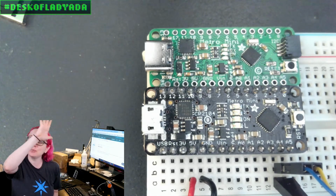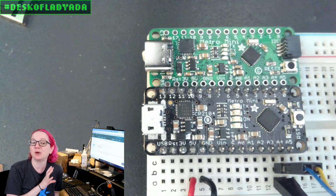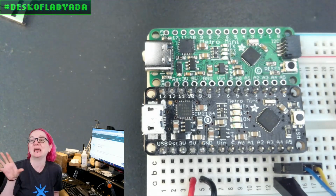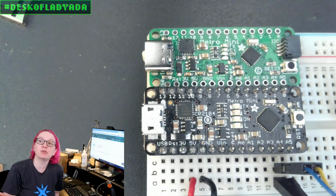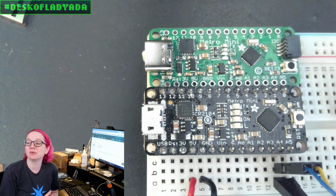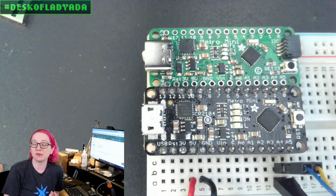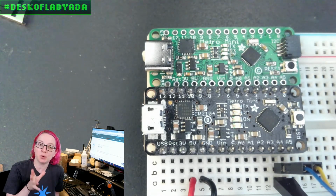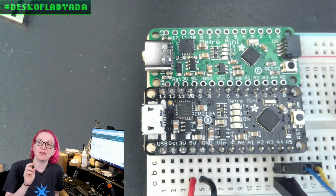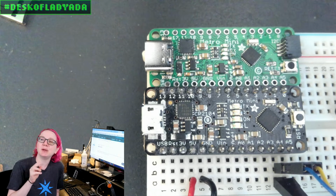But because of the chip shortage, all those Atmega 328 QFNs have been allocated. Like we've used them in production. And so in order to get this design out, I was able to find, Microchip had a couple thousand of the 28 QFN version of this chip available. And the 28 QFN doesn't have the extra A6 and A7. There's 2 extra analog pins.